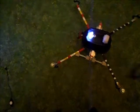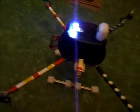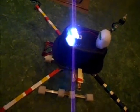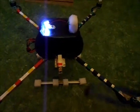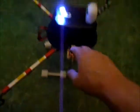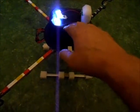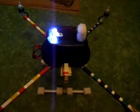What I did is I modified the feng shui copter a little bit more. I put on the old three LED array that I had mounted permanently up on the front — I took them off there and put them on a little swivel servo. I'm going to wire them into the landing gear, so when the landing gear are down the light will be on, and when the landing gear go up the light will go off. So that's going to be remotely controlled too by the gear switch.